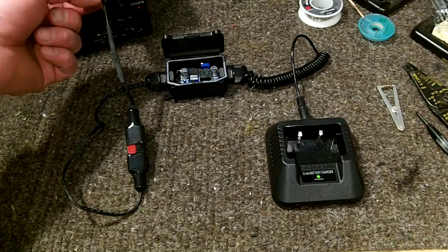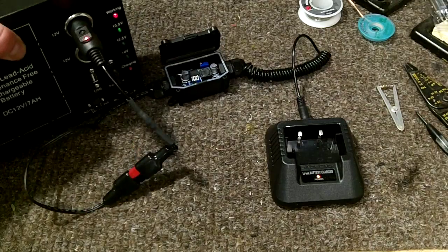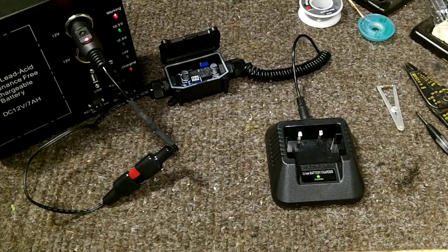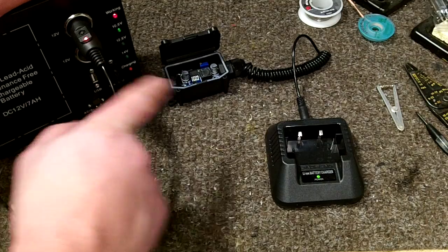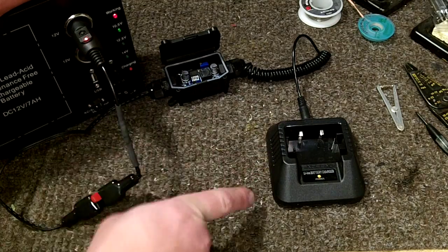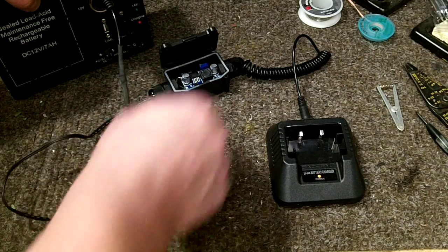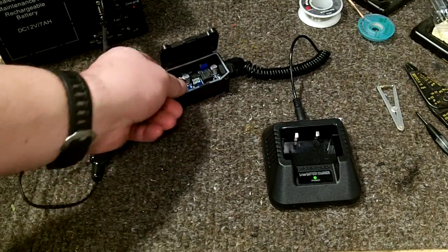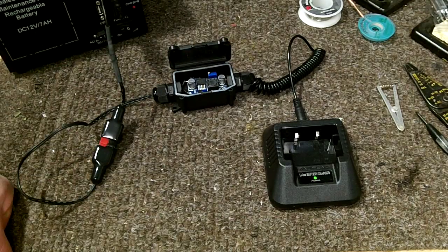I'll try to total up the parts and throw the cost down below. This plug here — I bought it for like $4.99, it was supposed to be able to charge this radio but it's direct voltage with no step-down. So I cut it, added a little extension line, used the other end to hook up through here, and it's soldered into the buck converter. Successful project, just took a little time waiting for parts to show up.